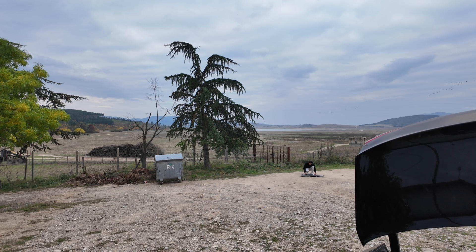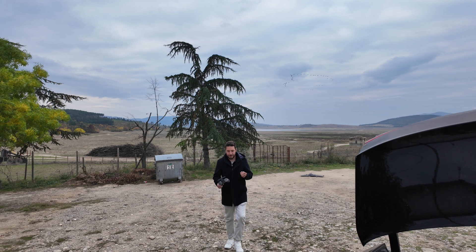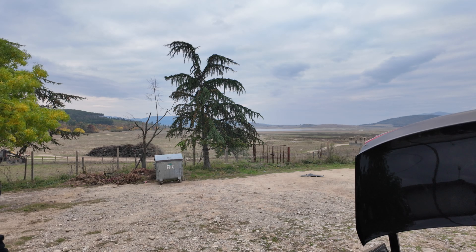The front motors are hot — about equally hot — while the rear motors are rather cool, which is good. Stabilization was on point; without enough GPS fixes it was just holding completely level, which is incredible. Structurally, we do have a twist on one of the arms — I'll need to find a more permanent solution. I'm also hesitant to hover longer because PETG is a good material but I'm not sure it can withstand motor heat; if it softens we could have a catastrophic crash. So the motor parts will be printed in nylon.